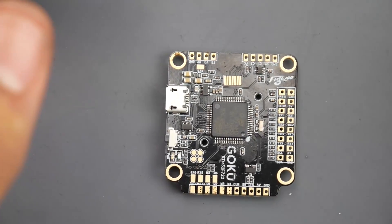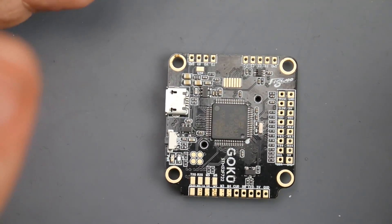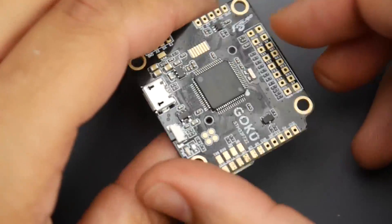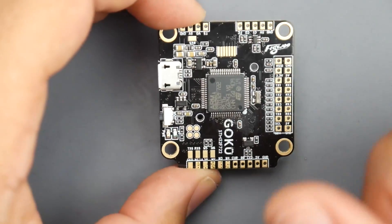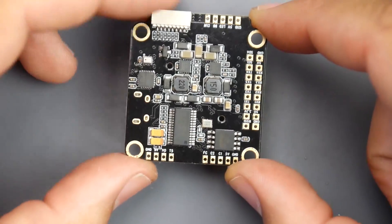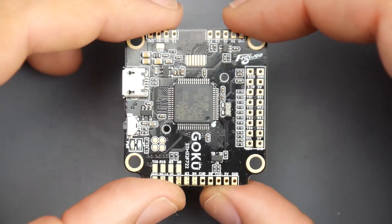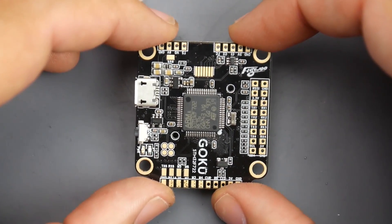And like that, we've gone over every single pad on this board. Also, if you're flashing this and your PC turns off or it disconnects and it's no longer connecting to Betaflight, you see this boot button here — it's kind of like a recovery button. Hold it in, plug in the USB, re-flash it, and you're good to go. Right now they have three flavors: the 20x20 and two 30x30s. I'll have them all linked below — they're at a really great price. They've been doing a good job in the market, not cutting any corners, and these boards look of really great quality in terms of execution. Everything's linked below, and I'll see you in the next one.